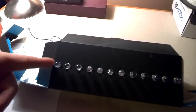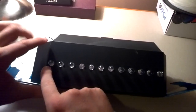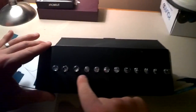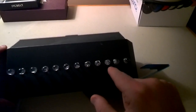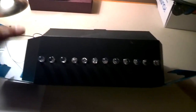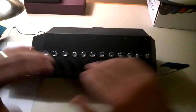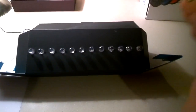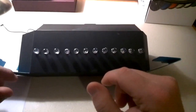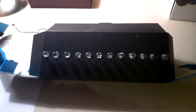I used the long leg to the left — long left is the positive, negative on the right. I used three lights here in the same pattern repeating: blue, green, and red. That's your first step: take your cardboard box, get your measurements, get them evenly spaced out or in any pattern you want — whether it's a star or a circle. Take your X-Acto knife or any device that can puncture through cardboard, get those two spots, and get all the legs through. Then we'll look at how to get all the wiring done.